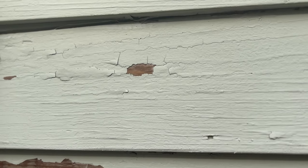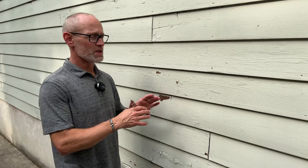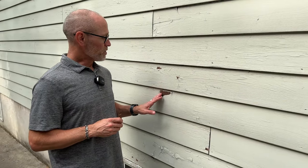If you're able to touch up areas as they start to peel, that can defer a whole house paint job for a long time. Many times people wait too long. This home is at a perfect stage — it has a little bit of peeling, but they haven't let it go five years past when they initially saw some peeling. If you wait too long, there'll be so much peeling that your investment to repaint will be quite a bit larger. So when you start to see caulk peeling or rotten wood, get your painter out there for an assessment.